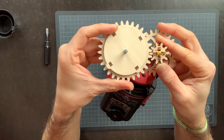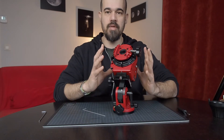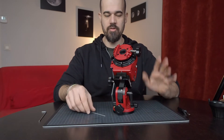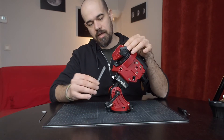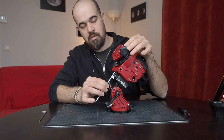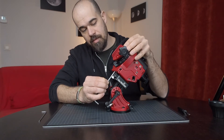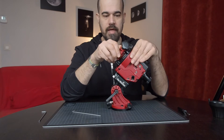If you overdo the adjustment, you may have problems due to eccentricity and imprecision in the manufacturing of the gear, creating extra friction at some points where the motor will stall. So you don't want to do that — you want to adjust the meshing just right. Start to screw in the worm gear meshing adjustment screw and check at the same time that the play is gone. You should see no play and no noise.